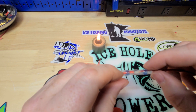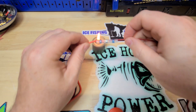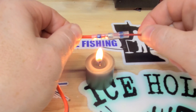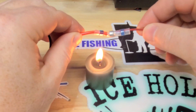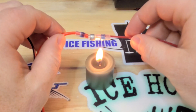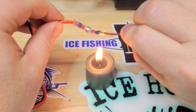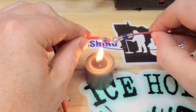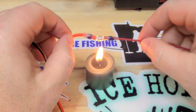Keep those blue bands on your insulation and your solder on the wire. It doesn't take much for that blue adhesive to start melting. We will send you an extra one just in case you screw it up. Let's get that side — there we go. Now work on the middle; that doesn't take too long either. You can see it starting to flow.